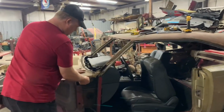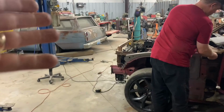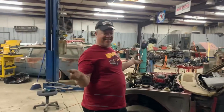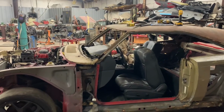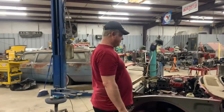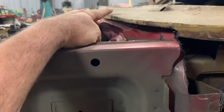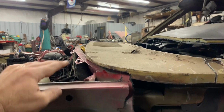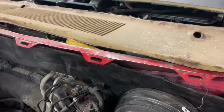After you had the fenders on it and everything, you could tell, because out here at the nose, things are up in the air like they shouldn't be. And I'm looking at the roof line, thinking that looks pretty good. And now it looks even better. But this tells the story. Right here, before, where this was hitting, it was straight, and that's where it should be. But now obviously this has got to go, and we've got to come on down. Or we just cut that. Cut this leading lip, cut a little bit more. Lip all the way gone.